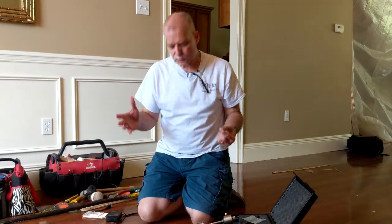So you find out where the old floor is wet, where the top floor is wet, where the plywood is wet — and that's how you know how much you have to tear up. There are times you can save it, but most of the time when it's that saturated it's useless. You have to tear it out and replace it with a new one.